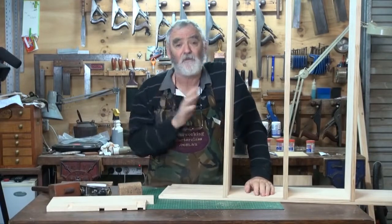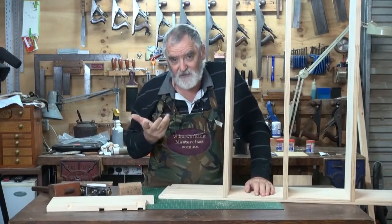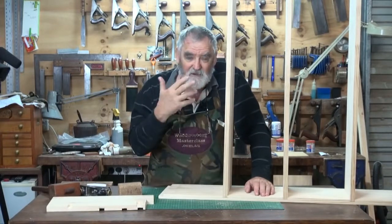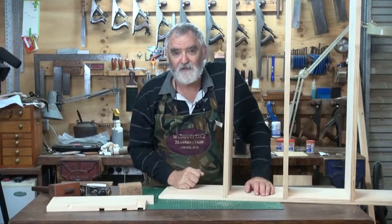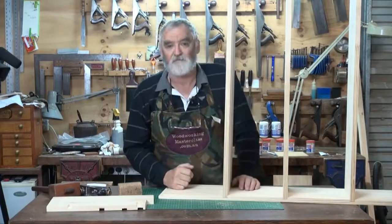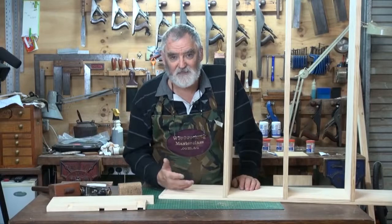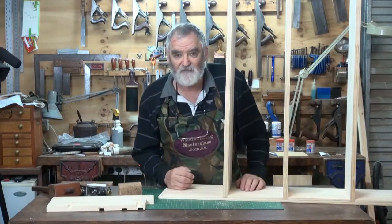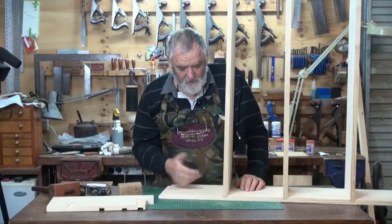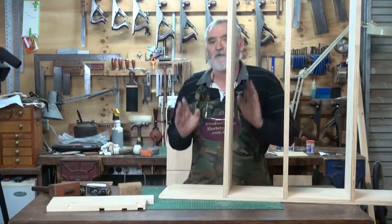The reason I'm not gluing them when I first put them in is because — depending on how quickly your glue goes off — if you have a little bit of trouble fitting these because they're a little bit warped or a little bit fatter, you can get them in and know that they fit. Then when the glue's in, you can move straight ahead. There's nothing worse than getting glue in, the glue starts to go off, your job starts to jam halfway through, then you've got to take the shelf out, clean all the glue out, and do it all again — and you risk putting glue on surfaces you don't want glue on. So this is a much better way.